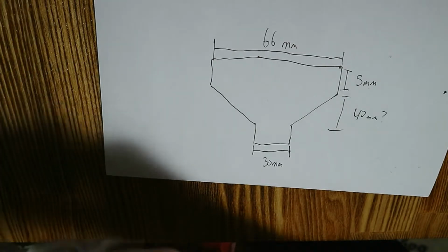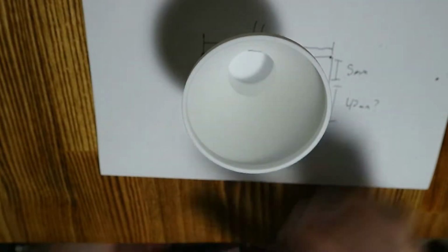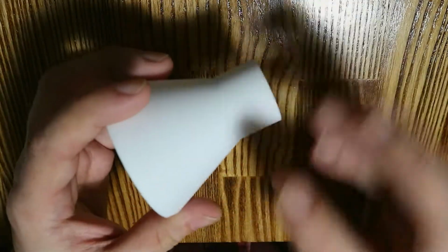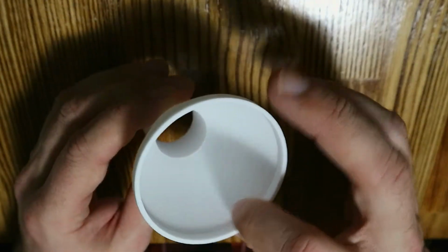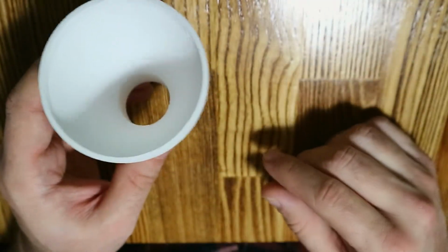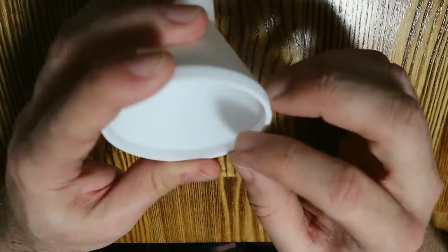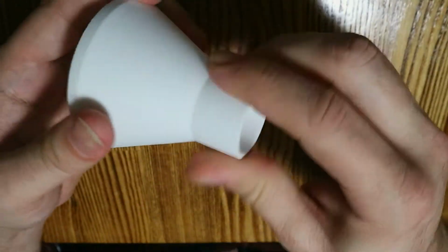I had this printed in their flexible white material, which is a sintered product, well, this is pretty nice. I'm going to move the drawing so that maybe we get some better contrast here. Which means I believe that it's a pile of powder, I think plastic powder, that a laser is fusing layer by layer, rather than the type of printer you would normally find in home use, where it's depositing a filament, a heated-up stream of plastic essentially in a line around. They offer that too. PLA is the main plastic they seem to use for that, and Shapeways offers that. It was only $2 less though, so I figured why not get this fancier material. It's slightly flexible, but really feels tough.